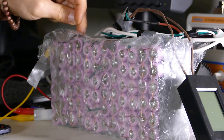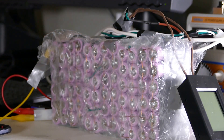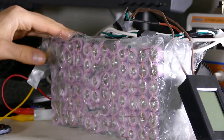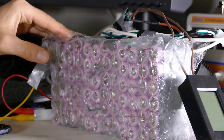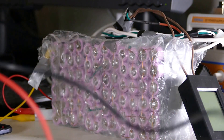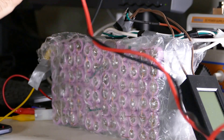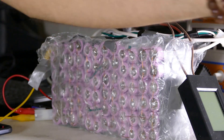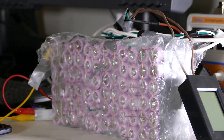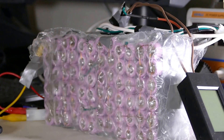The issue is it wouldn't even get past 4.04 volts, while all the other packs were balanced fine. Right now this pack is sitting at 3.66 volts, so maybe in about an hour we might be down to 3.5, then I'll start charging it back. I'll let you guys know what happens.